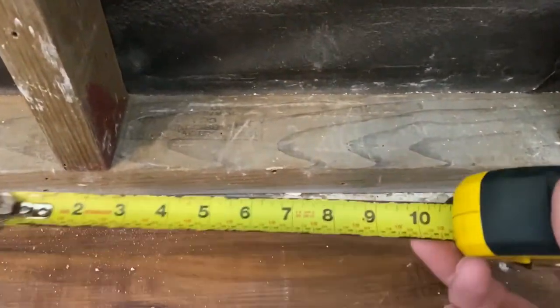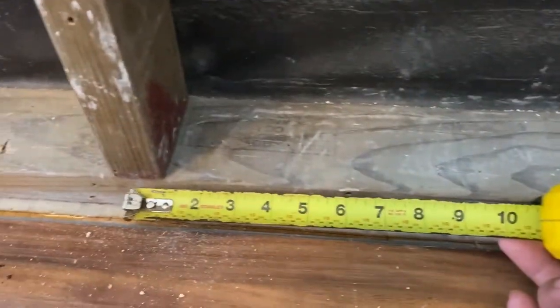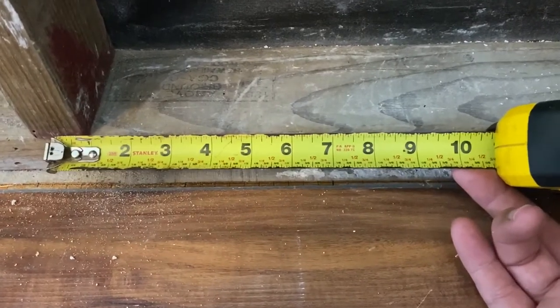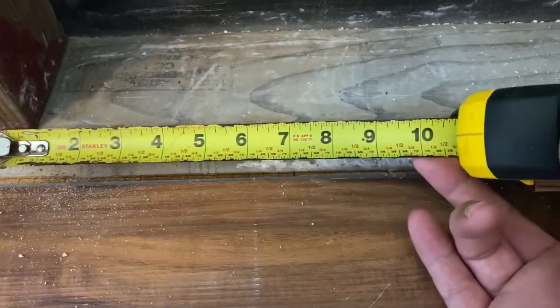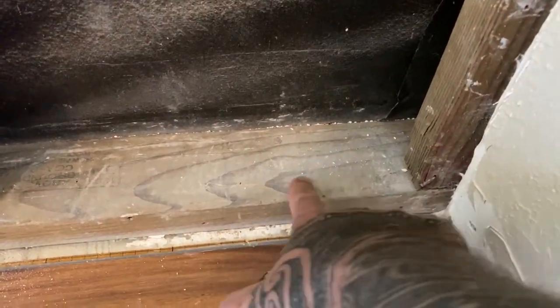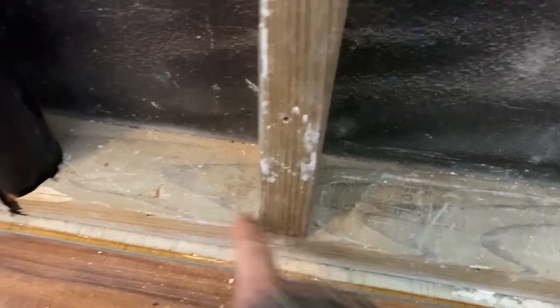All right, I just went outside and I measured from where the nail line is out there for this beam. So that stud down there, which is a 4x8, so it's 3.5 inches wide, goes from about 4 inches to 7.5 inches. So I'm going to end up drilling out here. I think I'm going to put the two holes for the PEX lines. And then over here, this one will be fine for the electrical.